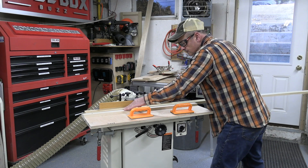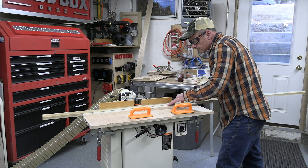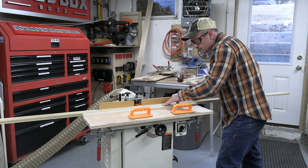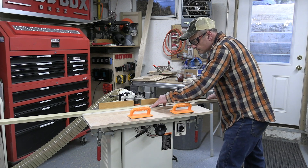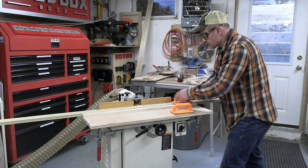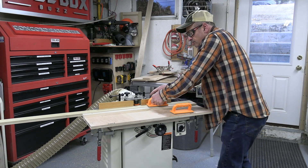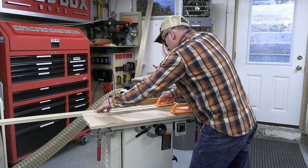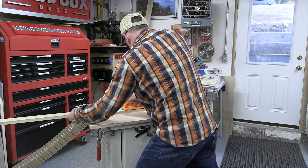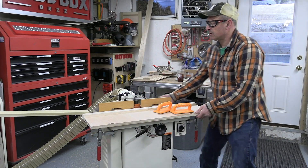When you push it into the shaper, you gouge your material. The second problem was clamping a fixed fence and pushing material through — the table was too short, so long material could flop or chatter, and there was really no way to support it where it was overhanging the shaper table. When routing these longer boards I would typically get gouges or imperfections, and I also had to physically push the material through the shaper, which is not safe.